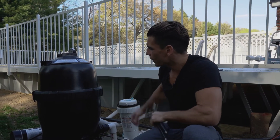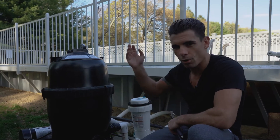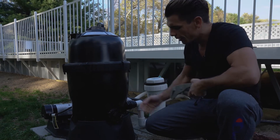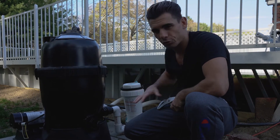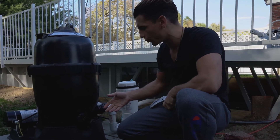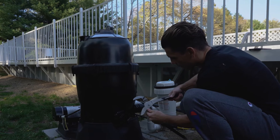The best thing you could ever do around a filter is put some small gravel or stone all around the area, because when I open this up to drain the excess water from the tank, it's going to go on the ground and get a little messy. Make sure you're not standing directly in front of it so you don't get blasted by water. I'm going to start by loosening this drain plug here just to let the water out. And on the top of this tank is an air release valve — it's really to let air in, and you'll hear it hiss right when I open it up.